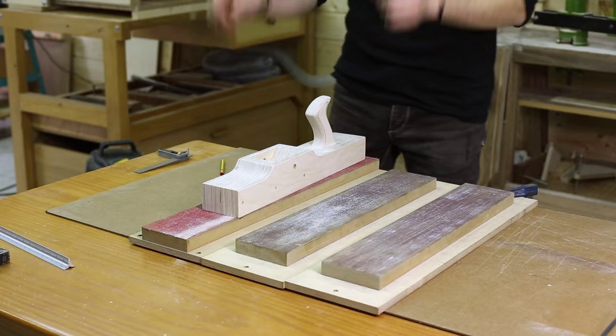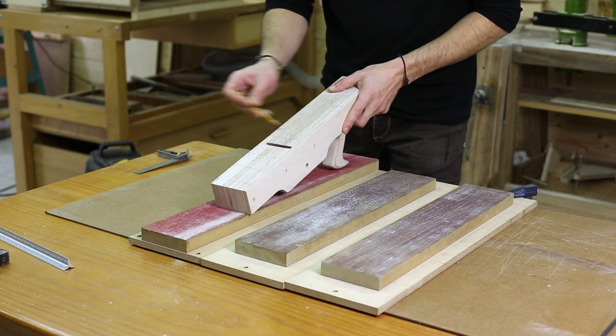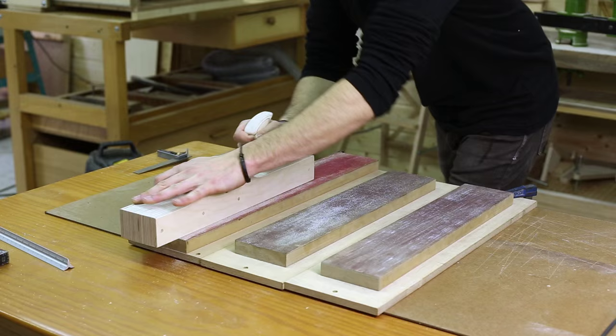Pay careful attention here. With sandpaper glued to a wooden block, sand the base of the hand planer to leave it perfectly square. If not, it won't work properly. You can draw some parallel marks with the pencil so you can know when the job is done.